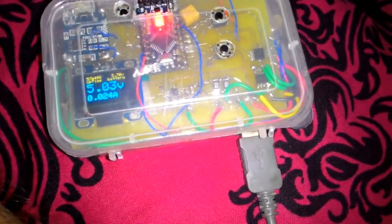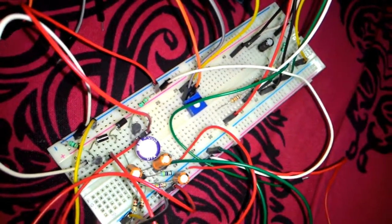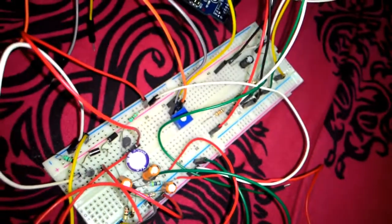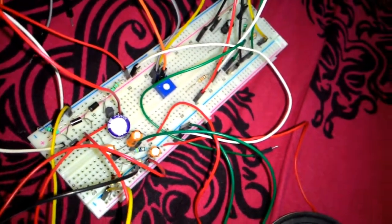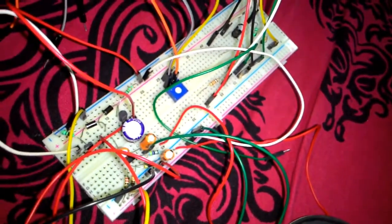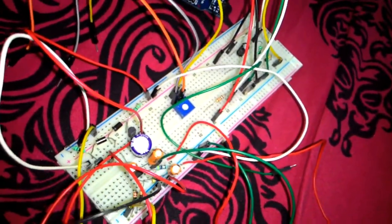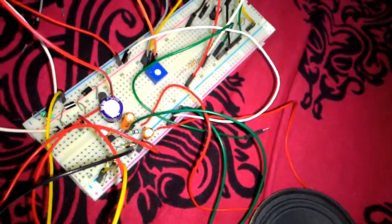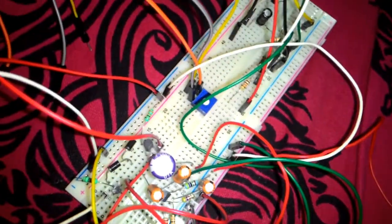Okay, and now what is actually happening is that in single supply, in the positive half cycle of the input, the NPN transistor, 2N3904, connected to the VCC, actually charges the capacitor. In the negative half cycle, it turns off the 2N3904, that's the NPN, and turns on the PNP. The PNP actually discharges the capacitor. So in this way the current is traveling in both ways, input and output, through the capacitor, which I was not able to accomplish previously, since I thought current would not be able to transfer directly from ground to that. Okay.